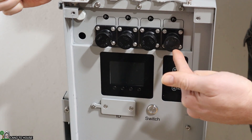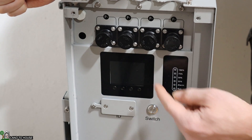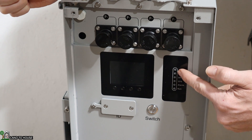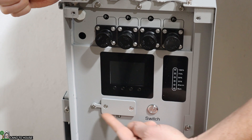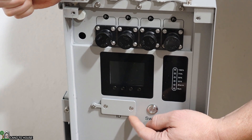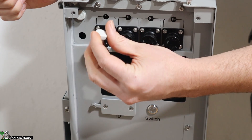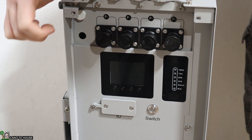Here on the other side of the battery there are four negative terminals — two of those would go to the inverter and two would go to an additional battery if you were to link more than one together. Down below that there is a display we'll turn on in just a moment. Over here there's a state of charge indicator along with alarm and run icons, so you can see by these LEDs what the state of charge is. Down below is the on/off switch, and over here are the ID bits. If you have multiple batteries linked together you have to change the ID of each one. Up in this corner there are two little white stoppers — I'd recommend not unscrewing those unless you need to, as the nut can fall down into the battery.